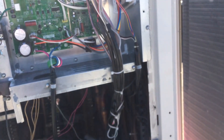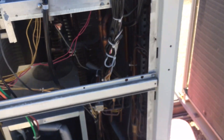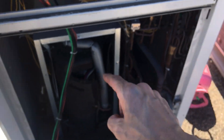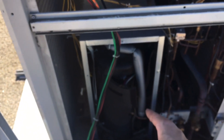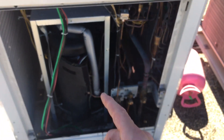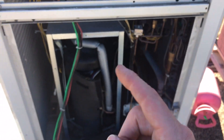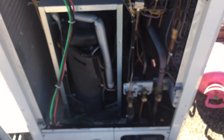You don't just shut off the system and try to operate the other system — read the manual. Another thing I'll do: I think I'll show you guys how a good compressor and a bad compressor ohm out. You do not ohm out these variable compressors to determine if they are good or bad — that is not the way this works. But just for a video, I might do that. I'll take these apart — the good one and the bad one — and see what our results are. I know what it's going to be.